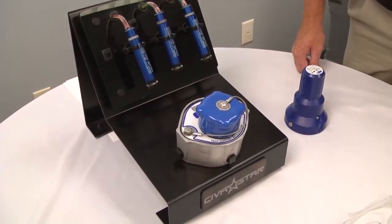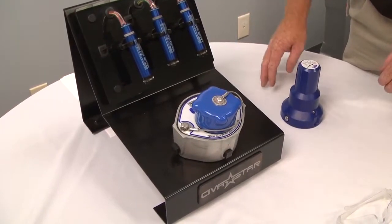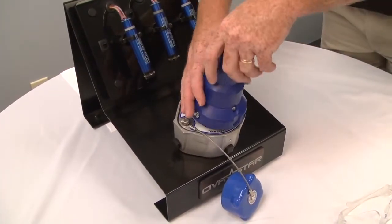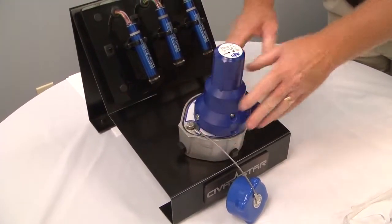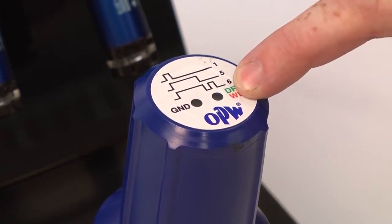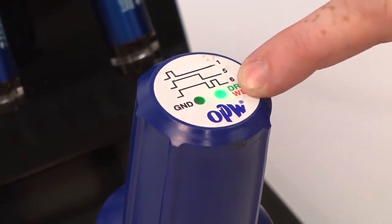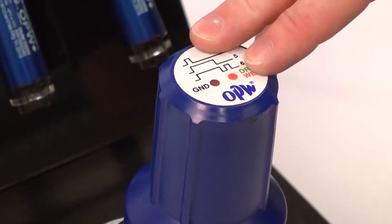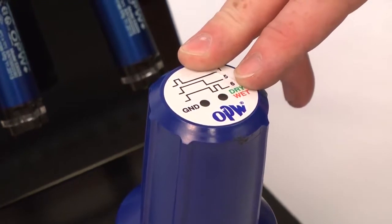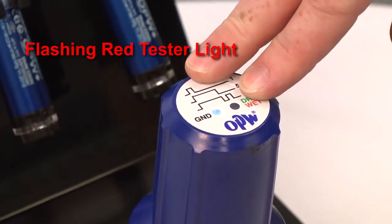If you've been in a loading rack and received a non-permit state at the rack, you'll need to go to a repair shop. When you get to the shop, you'll need to power up the system so you can troubleshoot what the issue may be. Today we'll use the OPW tester to power up the system to see what the state of it is. When the tester is connected, the green LED will be flashing if the trailer is showing permit. The number of flashes is in relation to the number of probes that the unit has. Now you'll see our tester in a non-permit state — the LED light is flashing twice. We broke the signal in our demonstration here between probes number two and three, so it's showing that number two sensor is the probable cause of the failure.